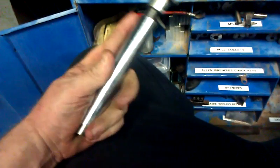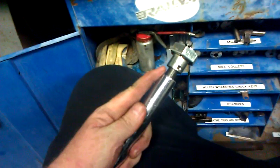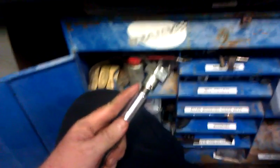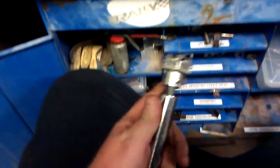That threaded area here is the end of the Douglas barrel that I've threaded — 9/16-18 National Fine. And that thing on the end there is my gas trap.